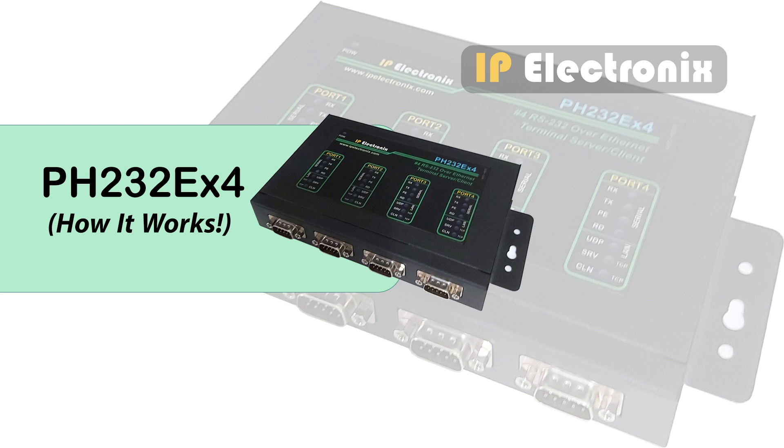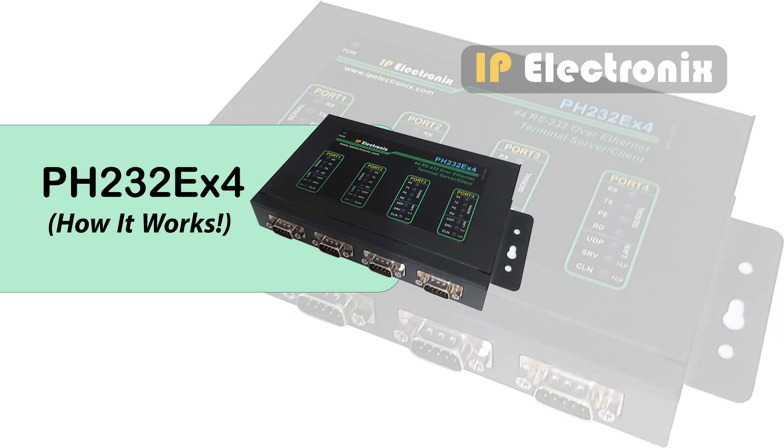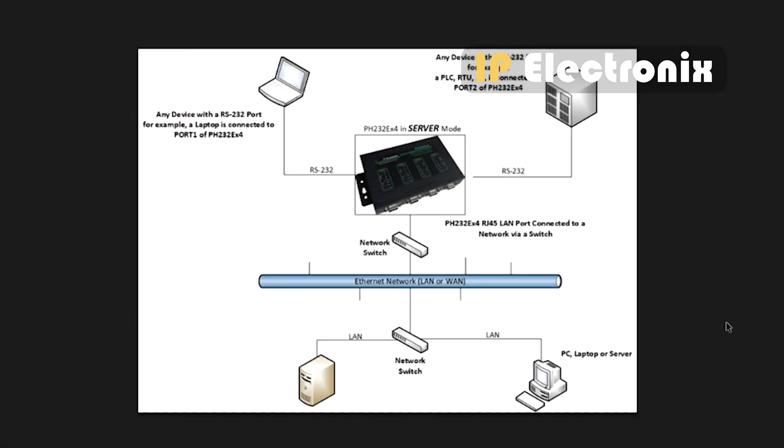In this section we will learn how the converter works. It can generally be used in two modes: terminal server or terminal client. The device can also be used individually in the network as a point-to-point or peer-to-peer connection, in which two converters — client and server — are used. Connect the converter from the RS232 side to any device which has RS232, and connect to the network switch through a network cable with RJ45 connector.